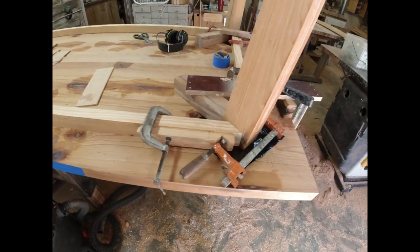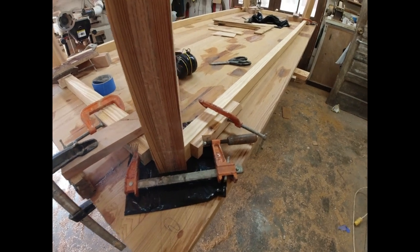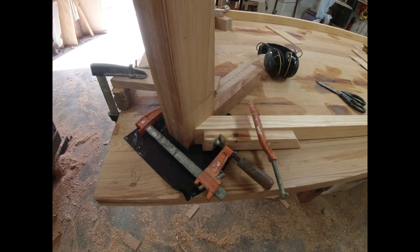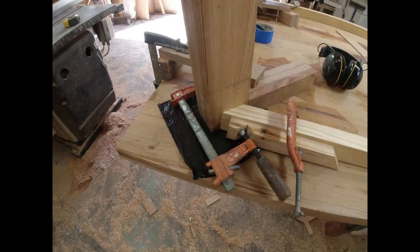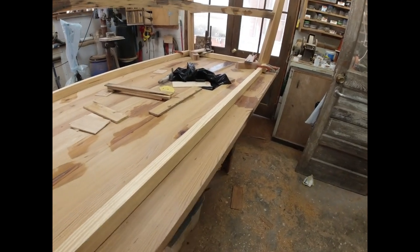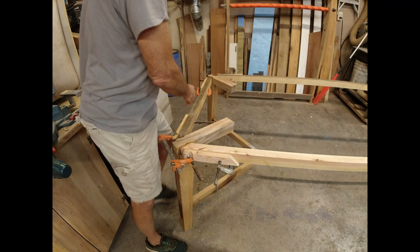I ripped up that scaffold board into aprons, planed both sides, cut the ends to 45 degrees, and I have a setup here to clamp them. I got them all dry-fit, so I'm going to epoxy these joints and clamp them. I know this won't be a very strong joint but it'll be strong enough to flip the table over and brace the joint, similar to what I did here — just glued it and after the fact braced it. At this point I'll finally be able to get the legs off the tabletop so I can work on the tabletop.